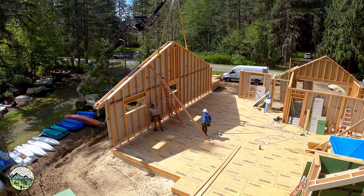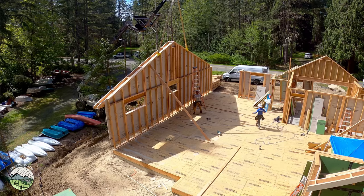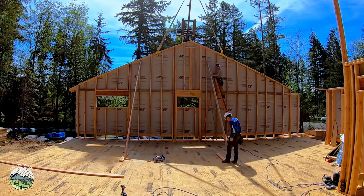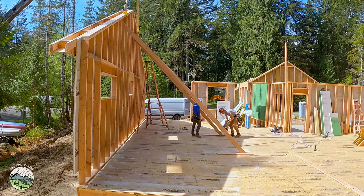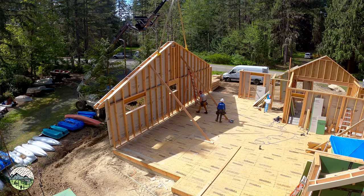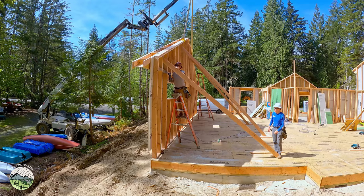When it comes to bracing these walls, use as long a brace as you can. We use structural screws to cleats in the ground and typically through the brace into a stud. We always start from the middle and work out. We try to be really strategic about where those braces land on the ground so we can frame our interior walls around them without needing to move them. We plumb all the walls with a laser, just offset four inches from the snap line on the floor. Kyle was cutting that brace along the floor to get a nice angle, which lets us get a couple more screws in. When I say screws, I'm talking about big timber screws — very strong. Everything gets fastened with those so it won't rip off.